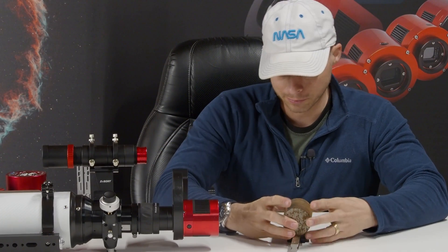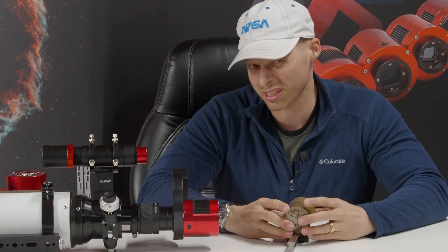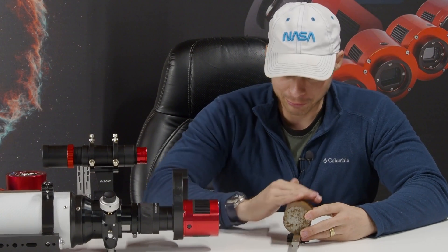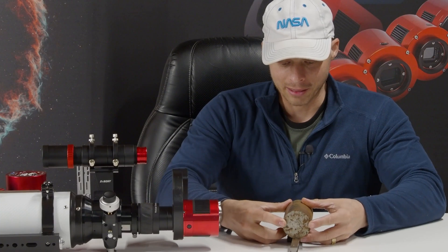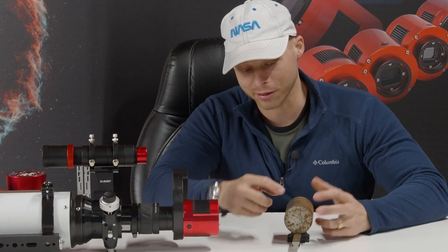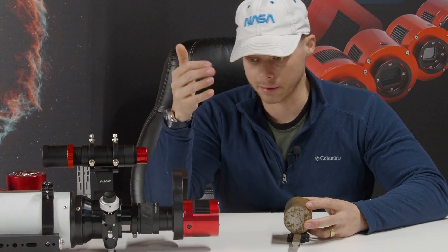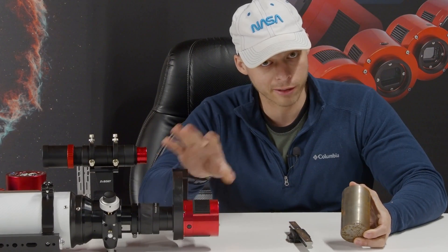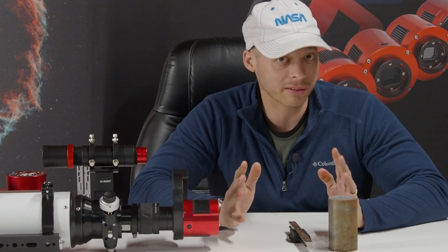This is kind of why this focuser is not the world's best focuser, and we're going to see how good it is when we test it in the shop. The entire focuser is attached down there by the actual track — there's no other type of support whatsoever on the focuser, and it's not the greatest pick of linear rail. This is a Crayford-style focuser, which means it doesn't have any backlash whatsoever, so I'm not really going to bother testing backlash.